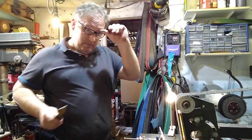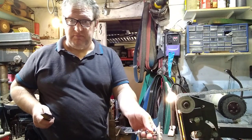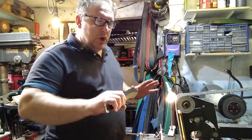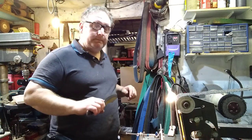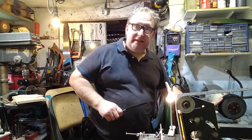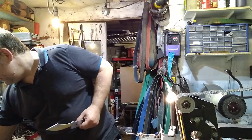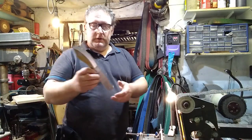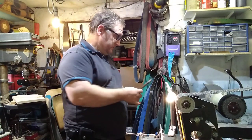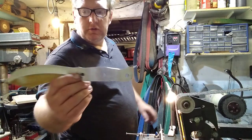So what I've done is worked out an order and I'll run through it for you. You get your thing set up — I do it 90 degrees all the time on my grinder, or you could set this up to your 10-degree bevel. You put your bevel on with a 36, reasonably quick, running the normal way. You can tidy it up with an 80 or a 120. Then you go to a neat size on air with some polish — you could use an abrasive flap wheel, whatever you want to do to get that done. So that's now finished. Don't touch it anymore. So you've got your choil section done.